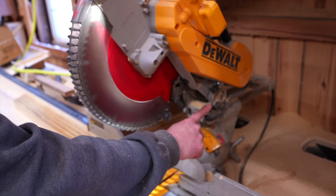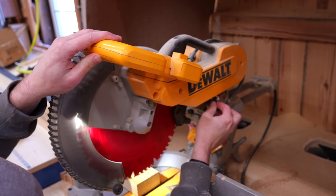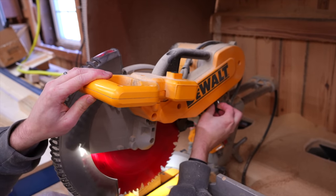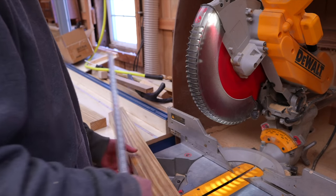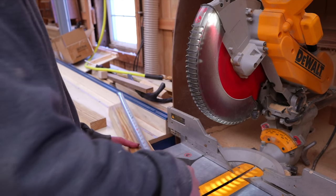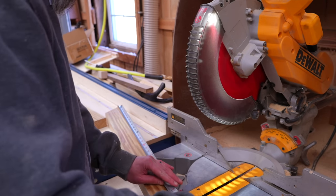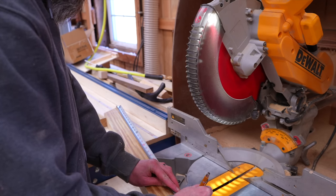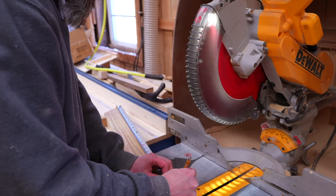All I have to do is adjust the depth stop down to the center mark I just made. A half lap can be done with a circular saw or even a table saw. Now I need to mark where my notch needs to go, measuring from the tip of my angled cut. My first mark is 26 and a half inches up, and the second is 29 and eleven-sixteenths. This will give us a perfect fit.